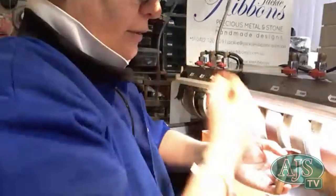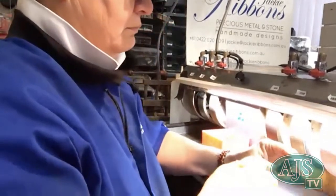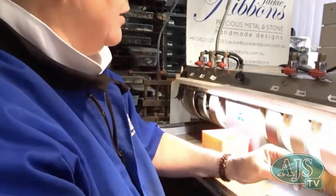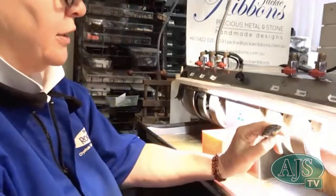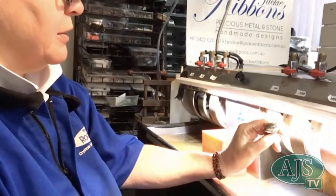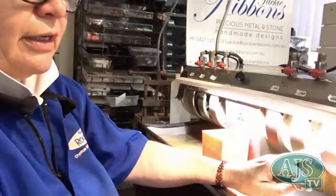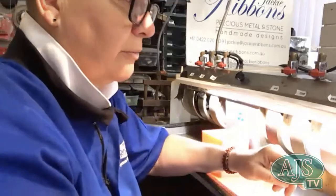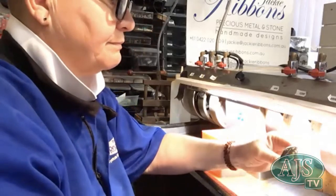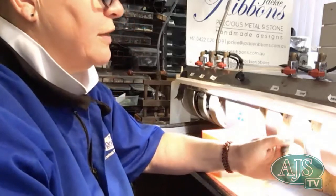Or there's not enough. Could you just run by the grits of the wheels that you're using at the minute there, Jackie? At the minute, I'm using 80, 180, 220, and then I go up to 600, unfortunately. Ideally, I'd like a 400 in between that. But on this set, I'm doing 600, 1200, and then up to 3000. And then we're going to be finishing on the polishing pad. No worries. Thank you very much for that. Okay. So we're going to go now from 1200 to 3000.